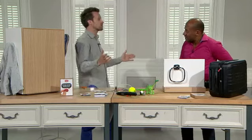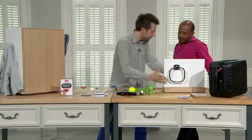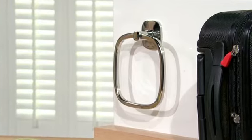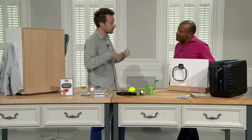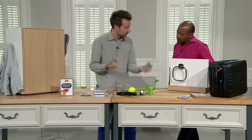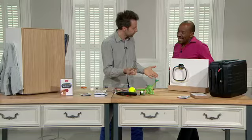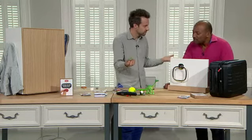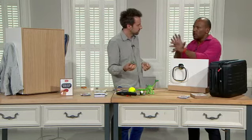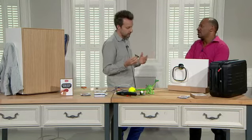Moving on, I'm going to jump into the bathroom. If you want to update your bathroom — install fittings, a towel rail, a toilet roll holder — it's pretty stressful. You have to get a drill, drill into your very expensive tiles. Will you crack the tile? Will you drill into a pipe? You don't want to do this. But Sugru takes away all of the anxieties of installing bathroom fittings. You can just use half a pack. Most bathroom fittings come in two parts: a mounting bracket and the accessory itself. You just press a little bit of Sugru onto the eyelets on the back of the fitting. You need to be mindful of the weight — suitable for towels and clothing, but probably not big heavy bottles.